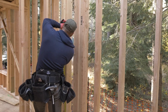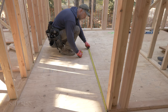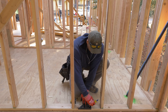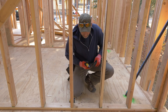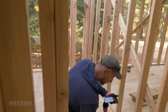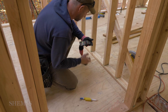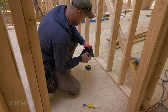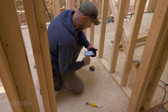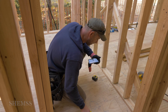We take the floor-to-floor measurement and divide it by the rise, and this should give you the number of stairs. To pass inspection, there are building codes dictating the height range of a single stair. Be sure to follow that code. So we need to make 18 steps at least. 122 divided by 18, we get 6 and 3 quarters step height.